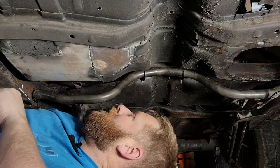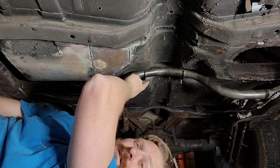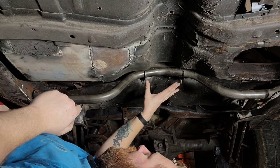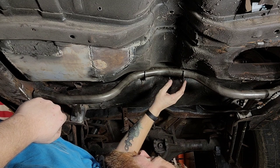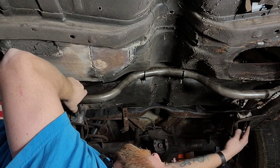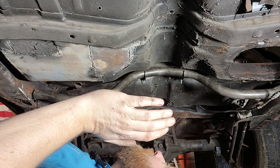Trial and error — I tried putting this bar in place and wouldn't you know, it's kind of hard to balance four pipes on your back underneath here. So later on in the steps, they show these little brackets that kind of grab onto the pipe, and I thought that might hold the pipe up so I don't have to try to hold it myself. So I drilled my holes in this little trough here on the rear frame brace of the body, put these on, and they're just kind of holding this in place. And the bars just kind of fell into place and are right about where they need to be — I'm not really touching anything.